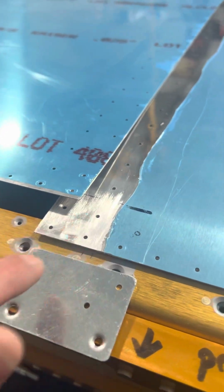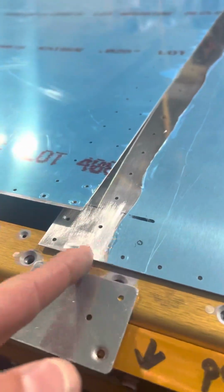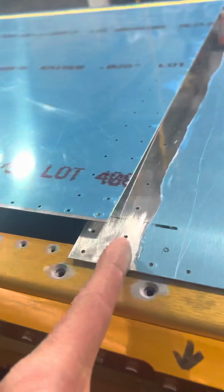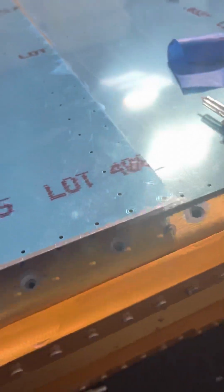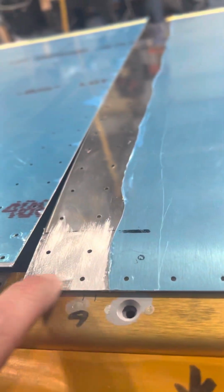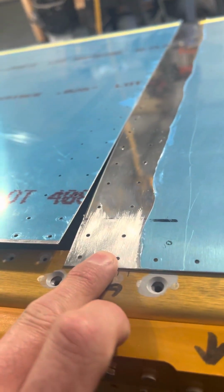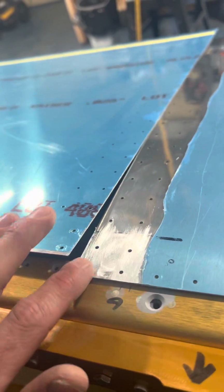And I basically made a 1.5 inch square section, and I used a marker, and I drew a line to make a box, and then I took that line, and if you see, that's the exact amount of distance these skins are going to overlap each other. So I took that and I sanded it down, with the most material removal right in the front, and I kind of tapered it less and less.